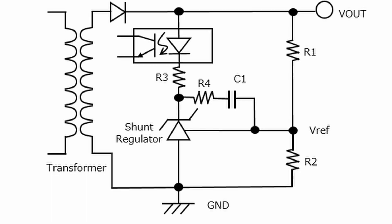There is also another type called the shunt regulator. Shunt regulators are mainly used to provide reference voltages and are not really intended to be used as power supplies. One of the most common applications is in isolated power supplies such as a flyback converter, where you'll see them on the secondary side providing a reference voltage to help regulate the output. It's a very interesting application, and we will be doing a separate video specifically on that topic.